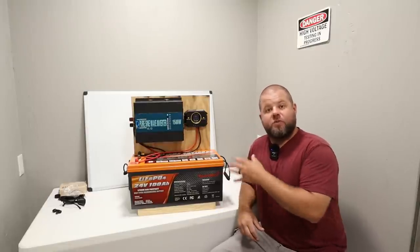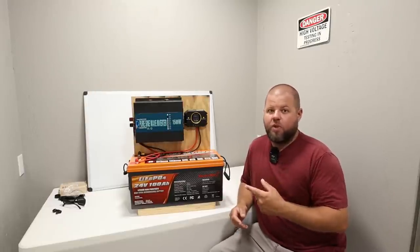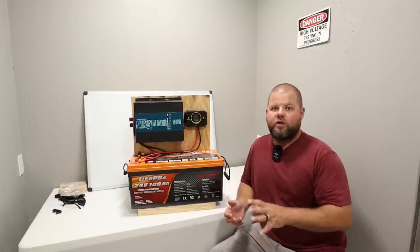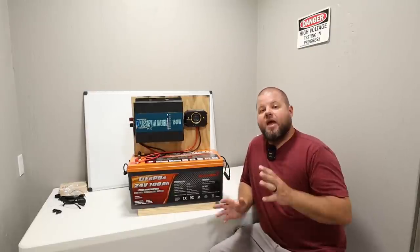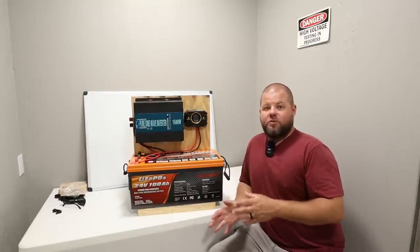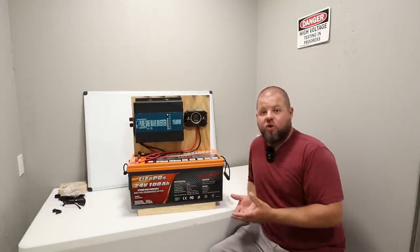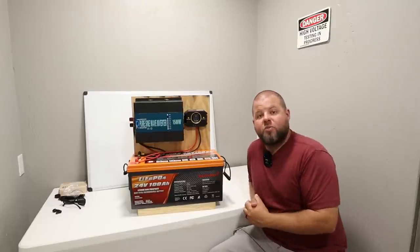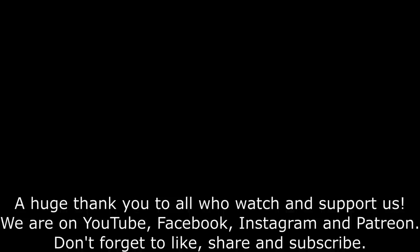Let's wrap this video up. That was a good initial test of this system. I built this because it's going to run a structure on my property that's not going to be anywhere near as demanding as a freezer and refrigerator running all night long. You always want to overbuild your system and have extra capacity — that way if you have cloudy days or heavy use days, you're covered. No matter what type of system you build, whether it's a huge off-grid system with 48-volt batteries or a smaller 12-volt 100-amp-hour entry-level system for a few hundred bucks, I highly recommend going with lithium. Thanks to EnjoyBot for sending out the battery, and thank you for watching and supporting the channel.